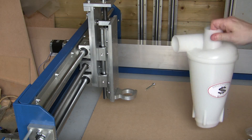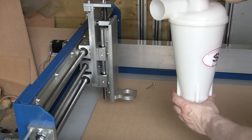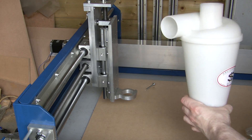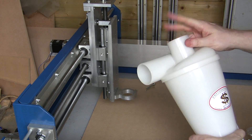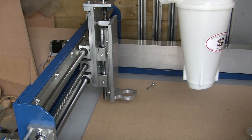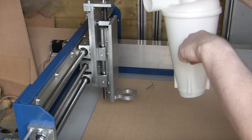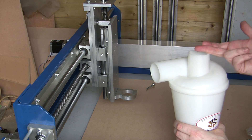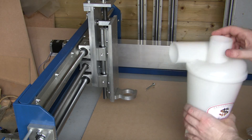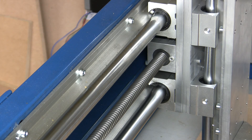I'm going to have to look into dust extraction to try and keep this place clean, because MDF is going to generate a lot of dust and it's not particularly nice dust. This is a sort of cheap plastic cyclone device that needs to be mounted on a bucket. You have an intake here which comes from your machine via a piece of hose, and this goes off to a domestic vacuum cleaner. What should happen is that the solids spin around the outside, gather speed, drop through the bottom and into a large collector, and then a much cleaner waste air gets sucked out through here and into the vacuum cleaner. So hopefully you end up with a bucket full of the large stuff before the vacuum cleaner gets anywhere near full.